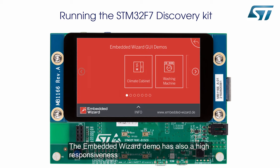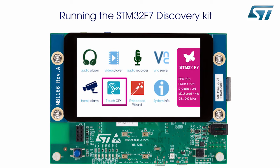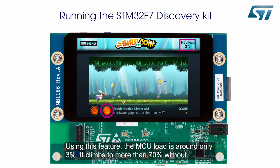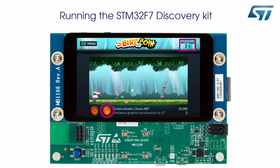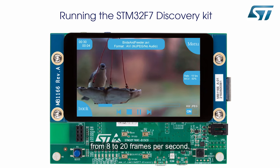The Embedded Wizard demo also has a high responsiveness and can be used in many application fields. Playing the Bird Eat Coin game, you can appreciate the efficiency of the Chrom-ART accelerator. Using this feature, the MCU load is only around 3%. It climbs to more than 70% without it. The JPEG codec increases video player performance from 8 to 20 frames per second.